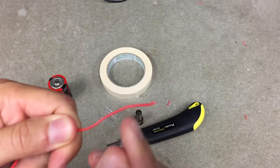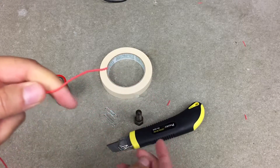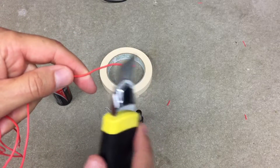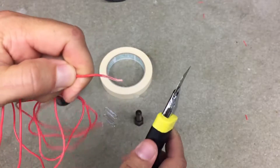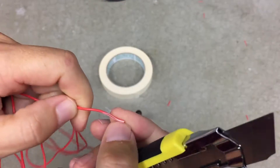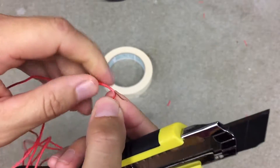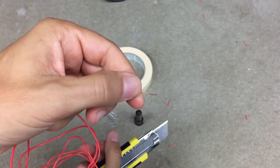The first thing is to cut the insulation off the ends of the wire so that we can connect it to a battery. I'm going to take my knife and shave off the ends. Just take that and shave, and you can see the copper inside right there. Now I can just peel this back a little bit, like that, and there's my copper wire. You can cut that off, leave it, or just pull it off — it doesn't matter.